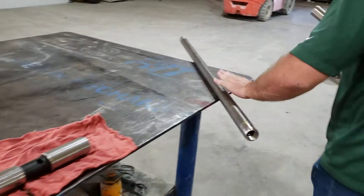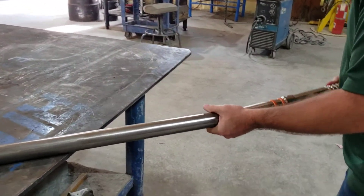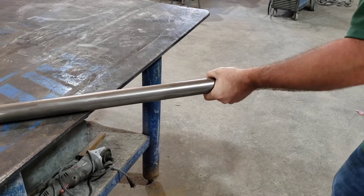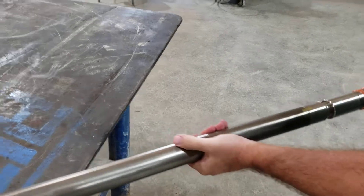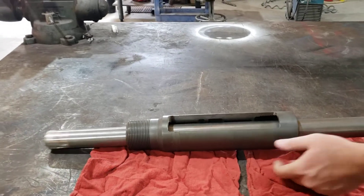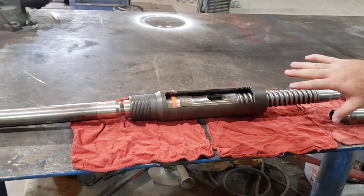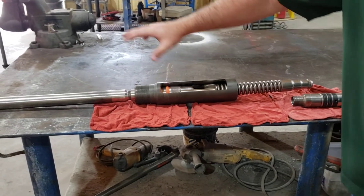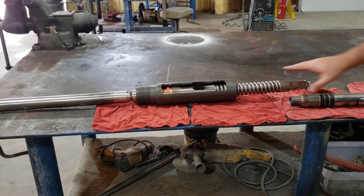So when we have one of our MFCs, we hook this up between the sub and the bumper spring so that way you can go through the profile. When this is set downhole, the fluid will go through the bottom of the MFC. And since this is packed off, no fluid can come around — it has to go through our tool, come up, come out right here, and go up into the tubing.